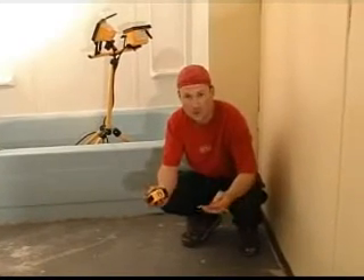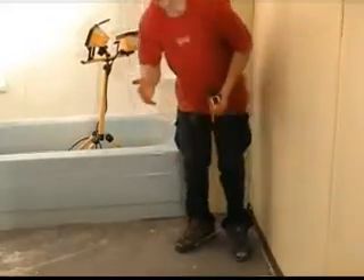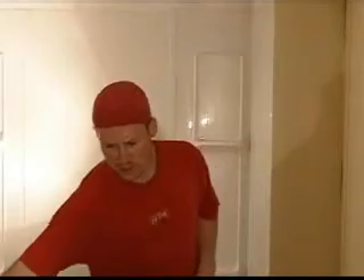I wouldn't even bother doing it here. It's called the three-four-five triangle. If your room is bigger, you would just double your numbers — so six, eight, ten — and keep doubling as the room gets bigger so you know the full square. Your general rule is you want to keep within about a quarter inch for your square. It will help you know when you're laying your tiles whether you can just lay them straight without worrying about anything. If you do have out-of-square, you have some more issues for laying out your tiles — it's not a huge deal and generally you can get around it, but in extreme cases you might have to rip out walls.